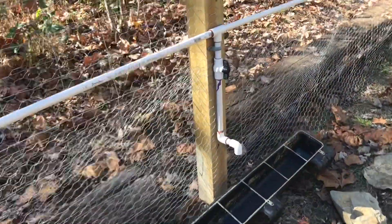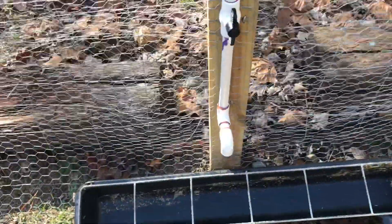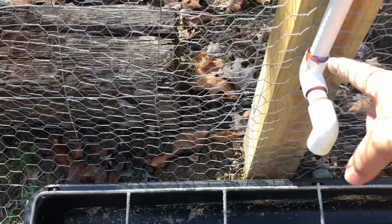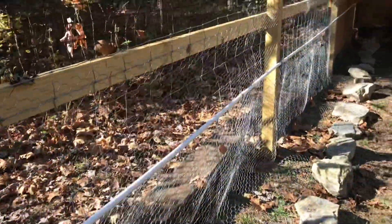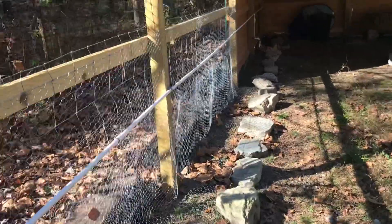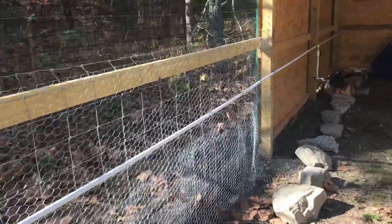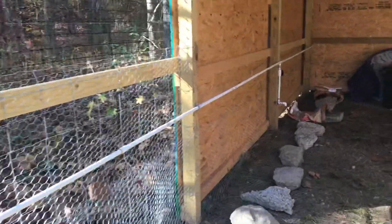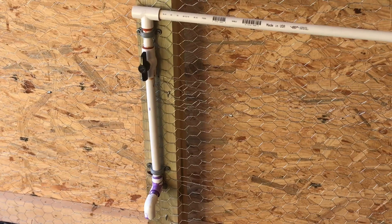So we've built this watering station here. The pipe comes out here, comes out across, dumps down — we can turn it on and off. But we've built all of the pipe with a descending angle, so that when we turn the water off and we open up the valves, all of the pipe will completely drain of water, so that we don't have to worry about it freezing and busting. So here's our invention.